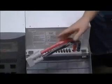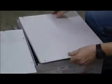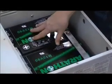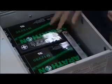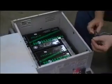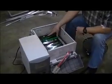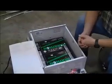So now the batteries are disconnected from the unit. Access to the batteries is very simple — there are six screws on the top of the battery compartment, and the lid comes right off. The two main batteries are 90 amp-hour Exide Marathon batteries. These are deep-cycle batteries used by the telecommunications industry. They carry a 10-year warranty and are very robust batteries that should last for many years of use. If the batteries need to be serviced or removed, they can simply be lifted out of this box and new ones replaced in, just like replacing the batteries in your car.